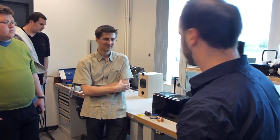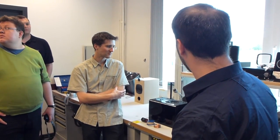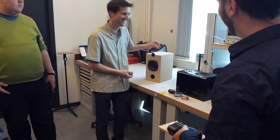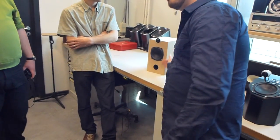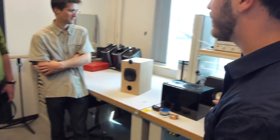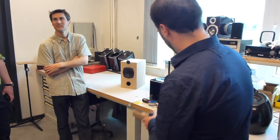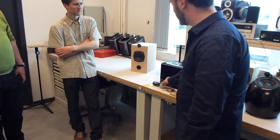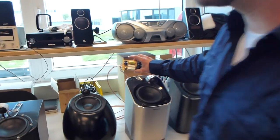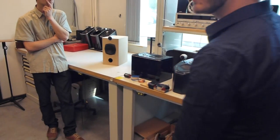With this particular loudspeaker, one thing quite difficult to get right is the time alignment. With a normal loudspeaker baffle, sound starts from one plane and arrives at the listener's ear at the same moment. With this design it's more difficult to align correctly, and the crossover point also comes into play. What's interesting is that we start with very large, very expensive components, and when it comes to production, the component size shrinks significantly. It's up to us to verify that we still have the correct values and that tolerances are acceptable.